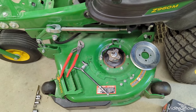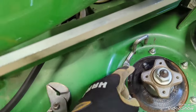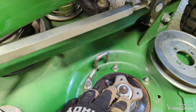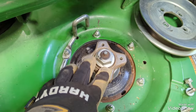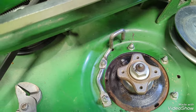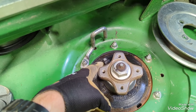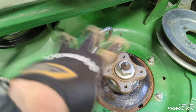I was worried that I had a seal go out and might end up having to replace the spindle already — thankfully I do not. What it appears to be is I did put a little bit of grease in there, about four or five pumps, at my 50-hour service. I'm guessing maybe this one had a little more in it than the rest of them. I haven't noticed any grease from under those, and the relief valve here just pushed it out.